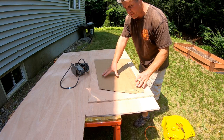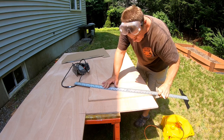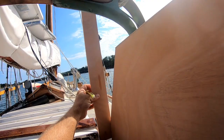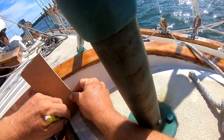Now that we've made some patterns and taken measurements and the plywood showed up, it's time to start cutting out the pieces. I'm starting by cutting out the port and starboard side pieces of the dodger. One of the trickier pieces to make will be the piece that arches over the sliding companionway hatch — there are quite a few corners and tricky measurements there. So I'm going to pattern some of this with a small piece of plywood first before attempting to cut out the piece itself.